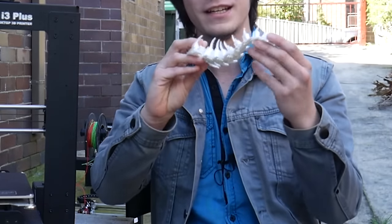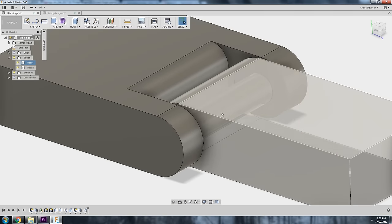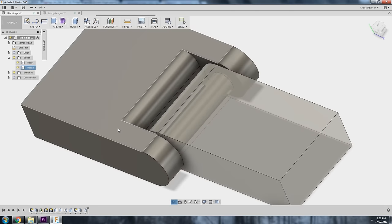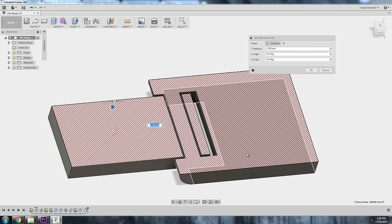One of the coolest things you can do with 3D printing is print-in-place designs with multiple moving parts that actually form one cohesive 3D print and can't really be separated once the print's complete. We're going to start with what I like to call a pin hinge. This hinge is pretty simple — I've designed all of these in Fusion 360. A pin hinge has a hollow in one part and a pin running through the center of the other part. These have a certain distance separation depending on your printer; it is a bridge across that gap, so you may need to increase or decrease that separation distance. For me, I did 0.3 millimeters and it actually works really, really quite well.